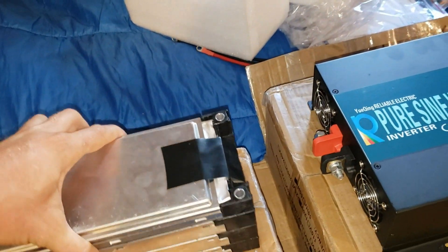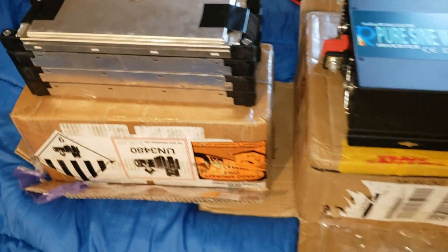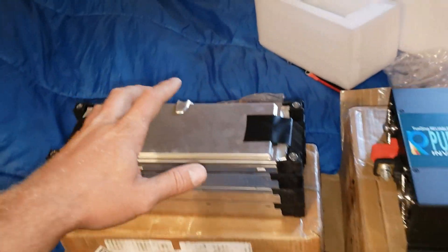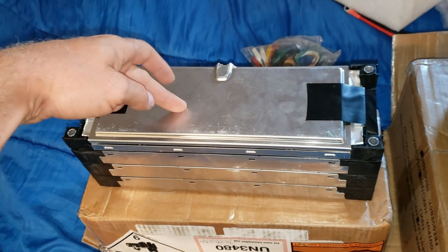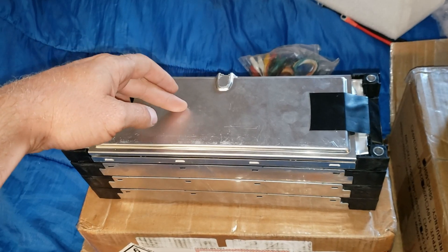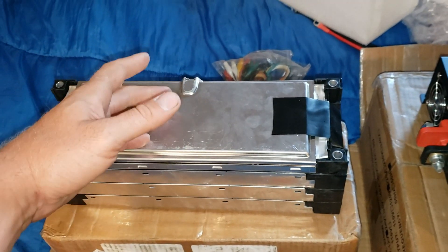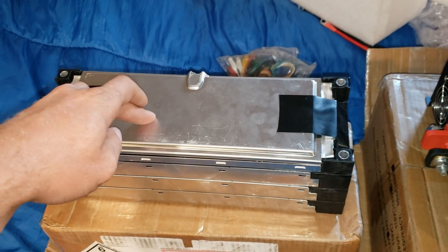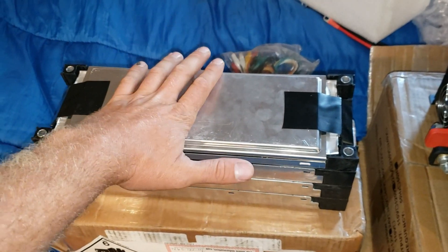I'm not going to be doing a huge test on them right now because all I have are these little baby leads. But we're going to be doing a capacity test. This is more than a 12 volt battery because it goes up to 16.8 volts full charge at 120 amp hours. So that's equal to maybe a 140 amp hour 12 volt battery — something like that for $200. That is so cheap.